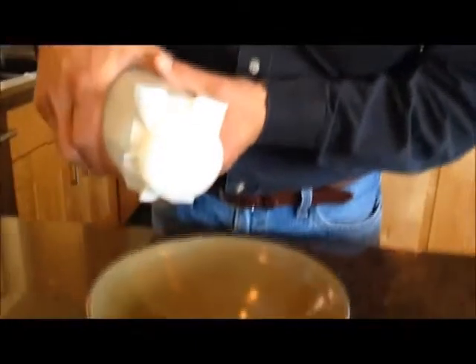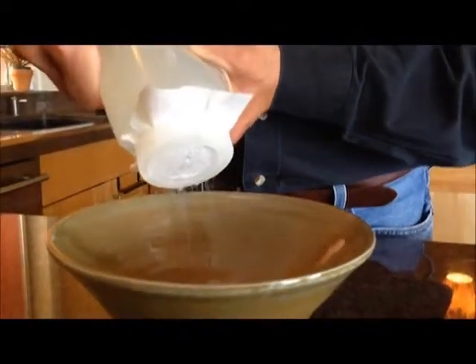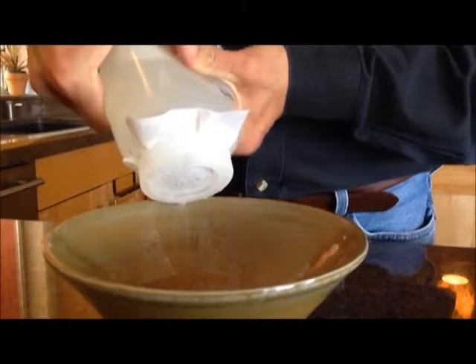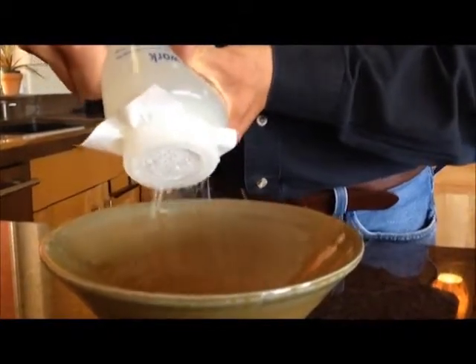We would also expect the wrap to prevent water leakage driven by the wind from moving through it as well. Let's take a look at how that performs. I'm going to tip this jar over a little bit, and watch what happens when I squeeze the water bottle. You can see all the holes in the wrap are allowing wind-driven rain to move through the product. Not a very good example — it doesn't stop air, and it doesn't stop water.